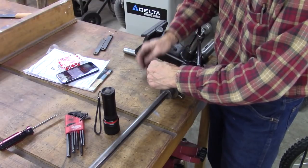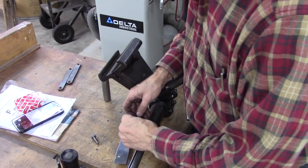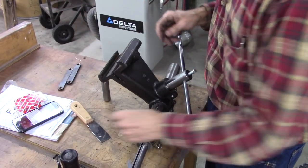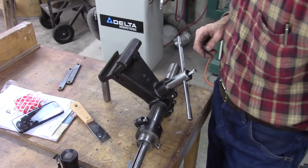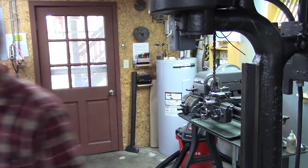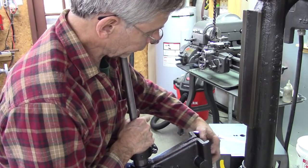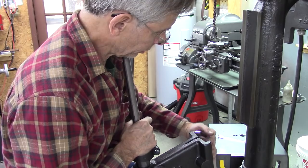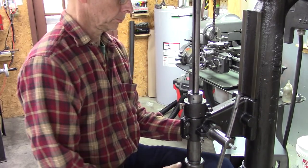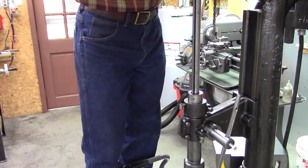Has one of those set screws on a set screw thing. Top set screw locks the bottom one. There's a piece of felt in this clamp here. It's to contain the oil used when you oil that bearing. Perfect. I think we're ready to put it in the drill press. Checking to make sure the little keys were still straight in there. I got a couple of shims I put in here because these dovetails were either made oversized or have worn. Okay, we're good.